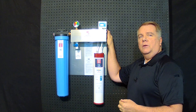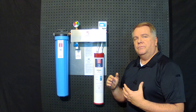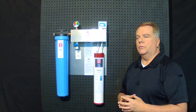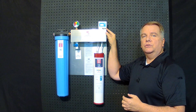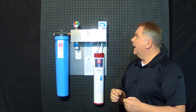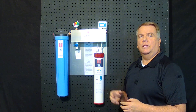We're also offering, as an option, the Terry Flow Meter. It's set at the factory and, based on the application or how the system's configured, it counts backwards from however many gallons we set it at. You'll see the gallons that you're using, and when it reaches the set amount, it will sound an audible alarm so you'll know it's time to change out your filter and the cartridge.